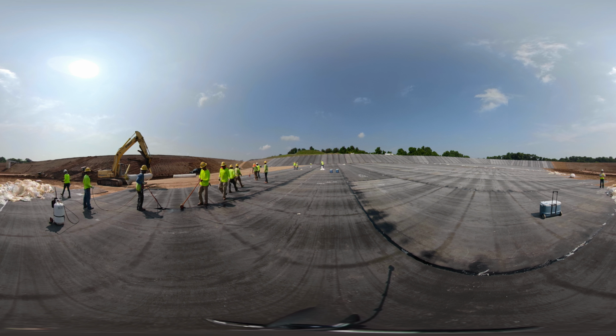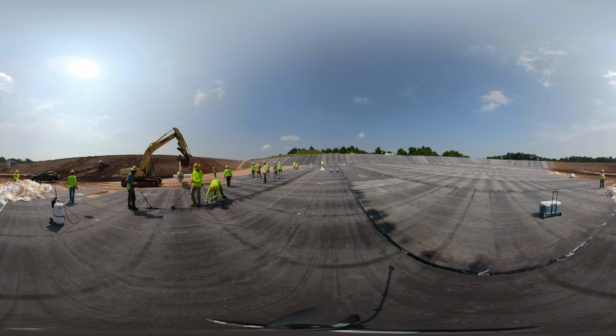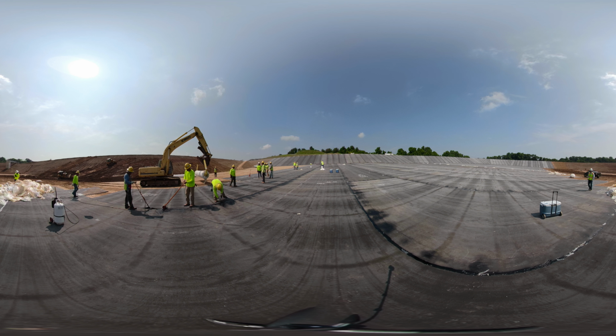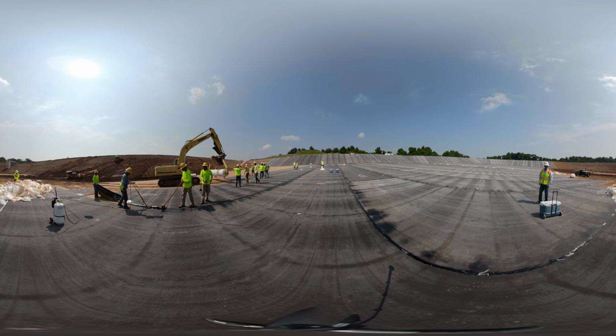The speed is a function of the rate at which the technician pulls the torch along between the overlap of the geomembrane panels. You will notice the pressure is applied by the 40-pound roller, maneuvered slowly back and forth directly behind the torch, where there's a molten material between both sheets. In the final step of the seaming process, another technician reheats the bituminous squeeze-out at the edge of the seam and trowels the bead smooth to seal the edge of the seam.